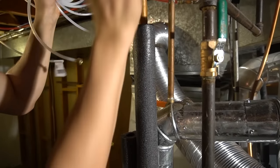And then I also installed the drain line. I had to return the one I had because it was 10 foot, not long enough. So I cut off 13 feet of this kind, and it goes up and around, and I zip tied it to the existing AC condensate drain line because this one was twirling up, and away to the floor drain. And that is it.